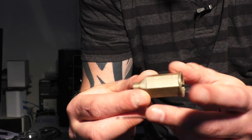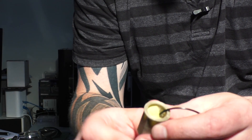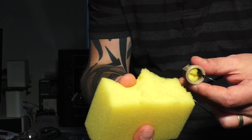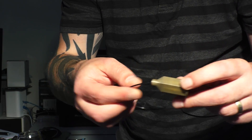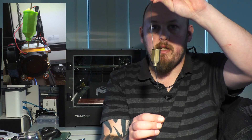It's basically a container with a nozzle in one end and then a large area where you can put in some kind of packing material. In here I just use a car washing sponge and rip a chunk off, then feed your filament through there, in-line from the spool holder to your hot end, like this.